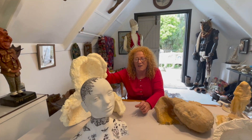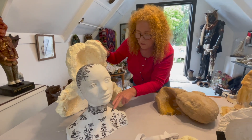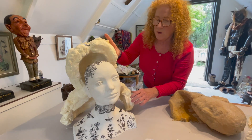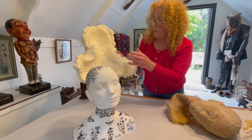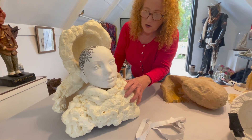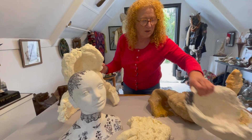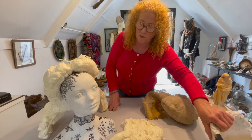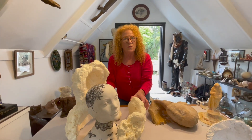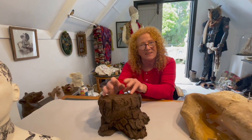The process of deciding where the divisions are is about avoiding the undercuts. The first part I will decide on is to keep her face whole — that means I will bring the division down here around that way, not the obvious choice. What you can never get is an undercut. She could have been a two-piece mould except I wanted the plaster to be nice and heavy on her face and support it really well.